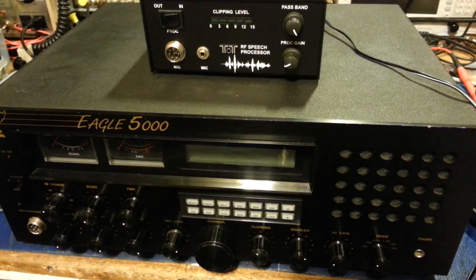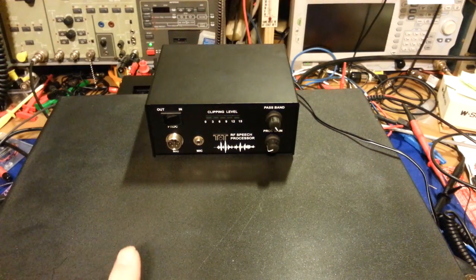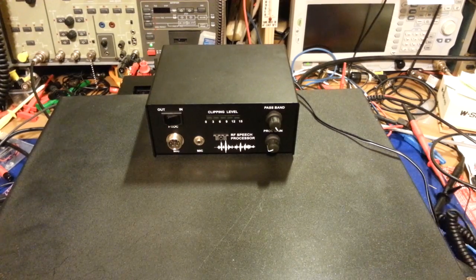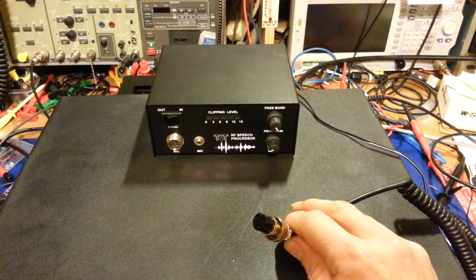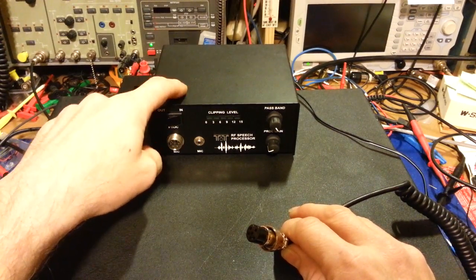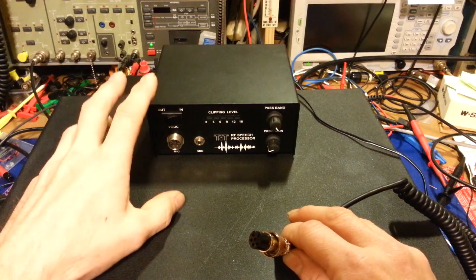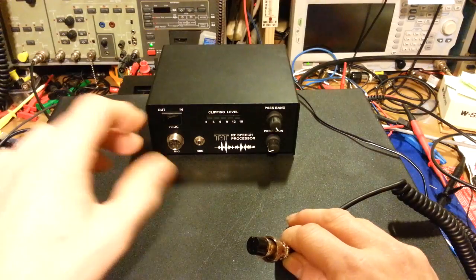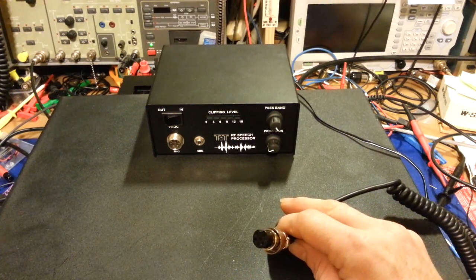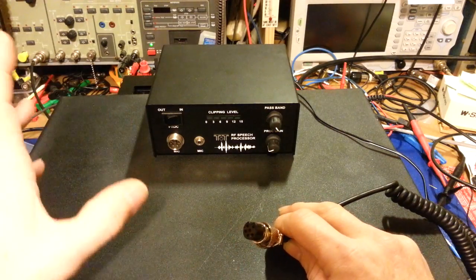What I've done — and you can do this yourself, it's just time-consuming because it's a lot of soldering and wiring — is make up your own adapter cord. It's going to be an octopus, for lack of a better term. Some people might think, just take that jack out and stick a 6-pin plug in it — that ain't gonna work. This jack solders directly to the front circuit board, which has the drivers for the LEDs and all the controls, and it's surface-mount design. Both jacks mount directly to that circuit board, so you can't just swap in a different pin-count jack — the pinouts are going to be different.